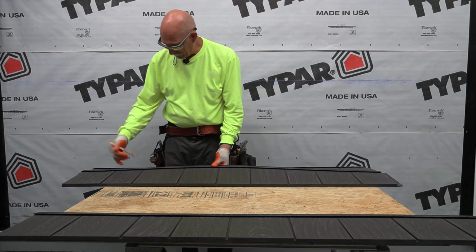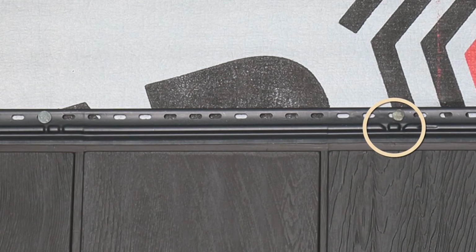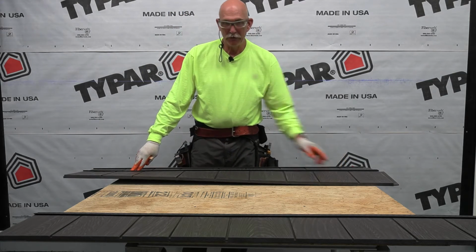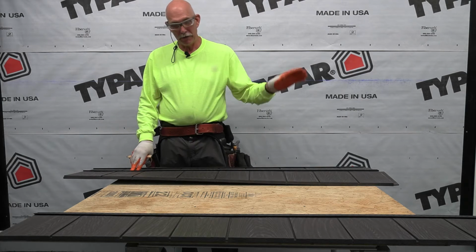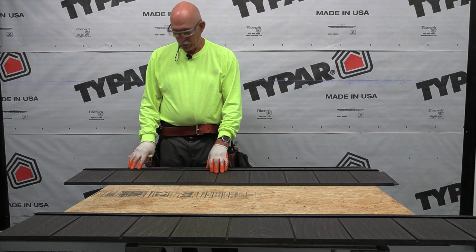And that's by these markings up on the top of your top block here. So you're going to see that there's a triangle shape, there's a square shape, there's a triangle shape, a square shape, triangle shape. Those are indicators either for your starter to cut, and there's also an arrow for the end of a panel. If you follow that protocol, all of these panels will line up and you will not get a repeat of the pattern. So that's the really neat thing.